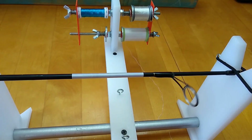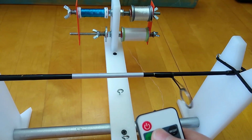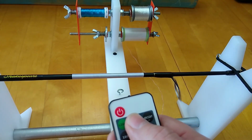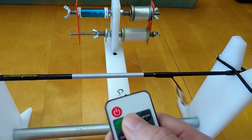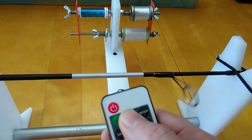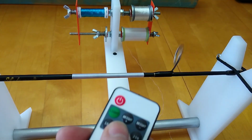The bright plus and minus buttons will speed up and slow down the motor also. I find that if you hit the 25% button, you can get away with 2 bright minus pushes to slow it down just a little bit more. On the third one, the motor stalls. If you do 2 pushes of the bright minus, it gets down to probably around 80 RPM, and it runs fine like that. One more push and it stalls the motor almost every time. That's just something to keep in mind. You don't have the low end that you would get with a pulse width modulator that is built for motors.